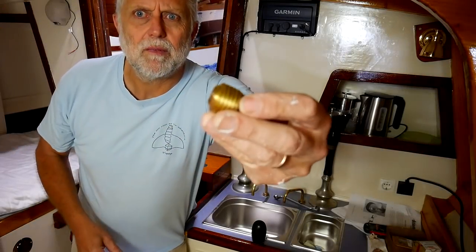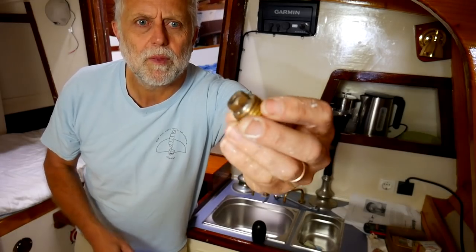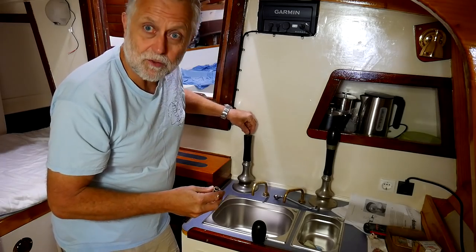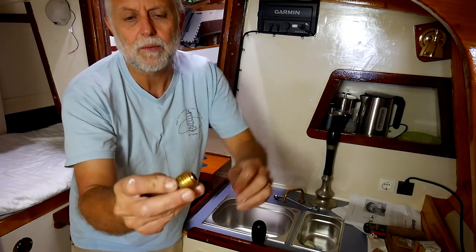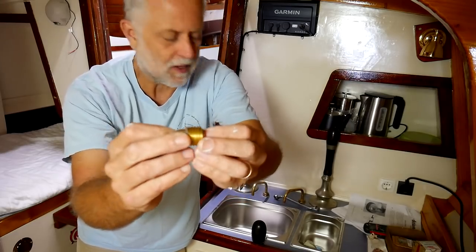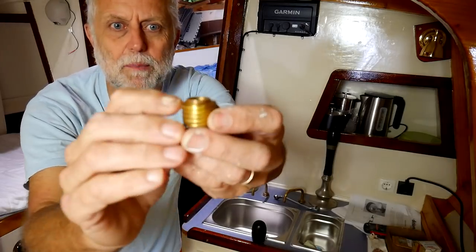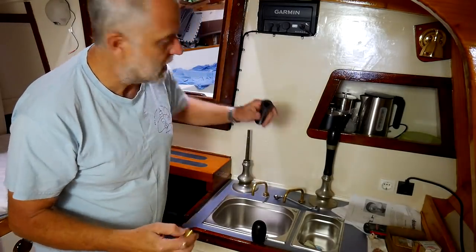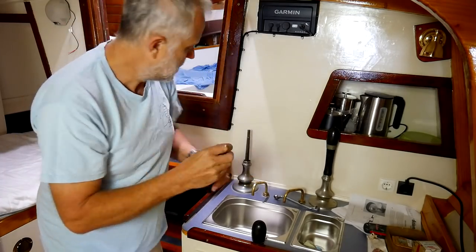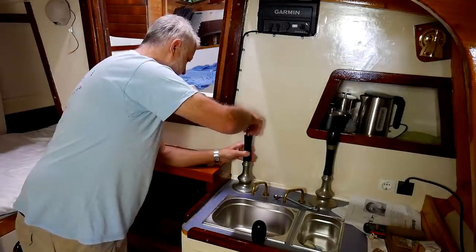And there we have, I hope you can see that, there we have the finished article with the nut that threads onto the bronze central rod and the 1 inch, 8 threads per inch on the brass there, and that. Also, a step on the end that locates down inside of there. So that locates that, holds it all nice and firmly in place.